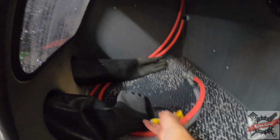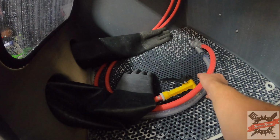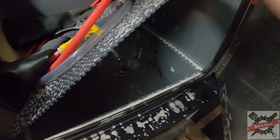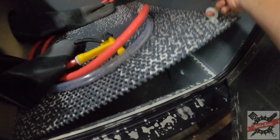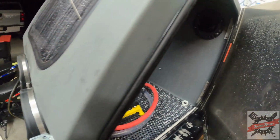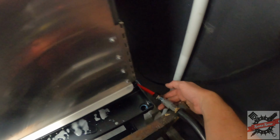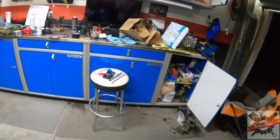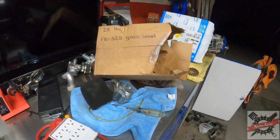A little look inside, you've got your freshwater rinse here, and obviously your gun. You can lift the lid, and the pumps are all inside of there. You just dump your media in there, and you fill it to the top drain over there, and you're ready to rock. Then you just plug up your air supply here. I'm shooting at right now 60 psi with the 170 325 glass bead, and that's all I'm doing.